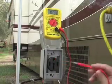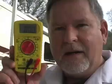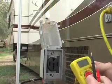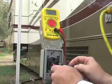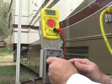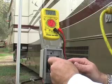So that means that side is working correctly. Now, what happens if we check both of the side pulls? On my multimeter, when I want to check one blade — one side of a 50-amp service — I turn it to 200. When I want to check both of them at the same time for 240 volts, I turn it over to 600. When we check both of the side pulls, you get a reading of around 240.